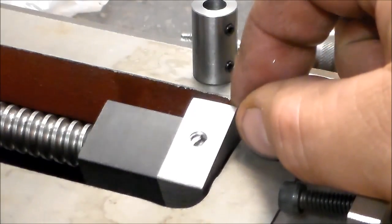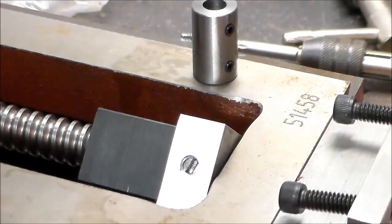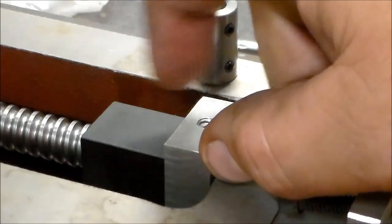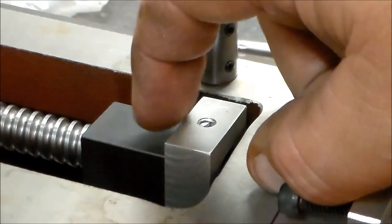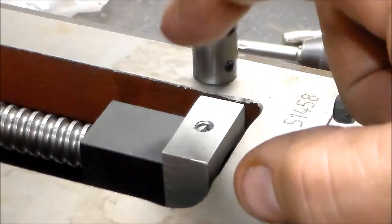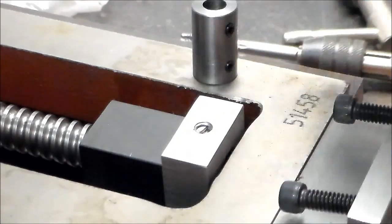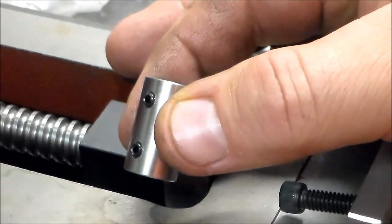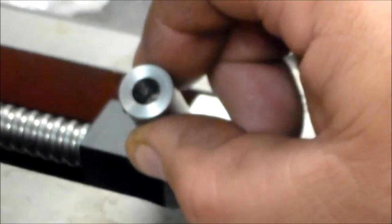While we're on the subject of set screws — you remember in one of the earlier videos I made this little set screw here just out of a piece of quarter-20 all-thread. That's fine in this situation because this is an aluminum block clamping onto an aluminum ball nut. The only thing this set screw is required to hold is just the friction of those ball bearings, which in a CNC situation should be very small — it just keeps the ball nut from rotating. These motor coupler set screws on the other hand are going to have torque and RPM, so you need to use real store-bought hardened set screws on your motor couplers if you make them.